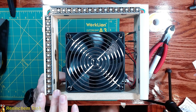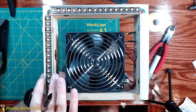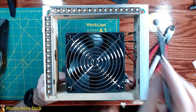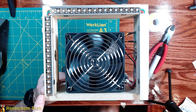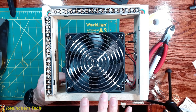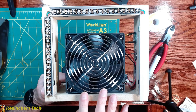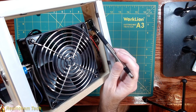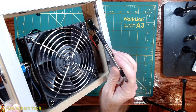Here are the LEDs mounted to the front of the station. I opted to use my aluminum LED channel that I've used in a lot of my projects. I had extra laying around, so I decided to go ahead and use it. We just solder the connections together, and I have the optional diffusers on here. I'm using 100 LEDs per meter for this project — I'm really interested in the amount of light and just white light. I'm not looking for all the different colors and effects of WLED, which is another reason why we're going to use ESPHome.